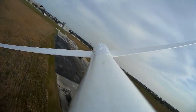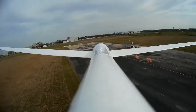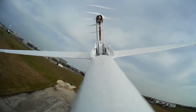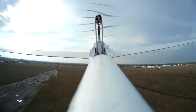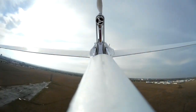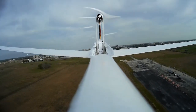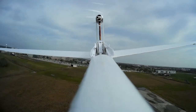While I'm at it, I want to nerd-rant for a second. I've always disliked what I call software switches, just like what the Mobius has — and in fact, many electronic devices have these. These are switches that don't completely disconnect the device from the battery. This means that when you turn the device off, it just never really turns off because it's not a hard switch. Which means if you stick the thing in a drawer for some long period of time, you are actually in danger of over-discharging the battery — which is a serious thing for a lot of modern devices that run lithium-type batteries. I'm seriously considering hot-wiring a mechanical switch into the thing so I can totally disconnect the battery from the device and won't have any leakage current, as they call it.